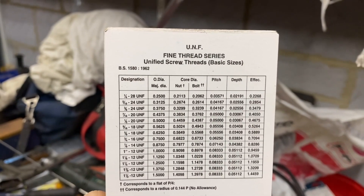So I need to find a 5/16ths UNF. Now I haven't got a 5/16ths UNF die — I've hunted high and low but I don't seem to have any. I've got one more place to check, but for the purpose of just a boiler test, I'm going to put a lot of tape on a 26 TPI plug and do it up. I won't be going mad with tightening it because I don't want to damage the threads, but hopefully that will be enough to hold it. If it doesn't, then we'll be waiting for a die to turn up. So I'm now going to pass you over to future me, who will be at the club with both engines — the Rob Roy and the Jinty — hoping to get tests on both. Jinty is my priority; Rob Roy is secondary.